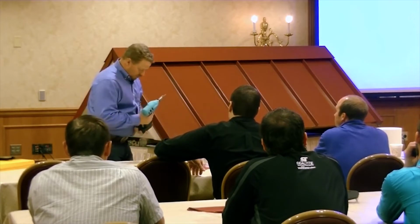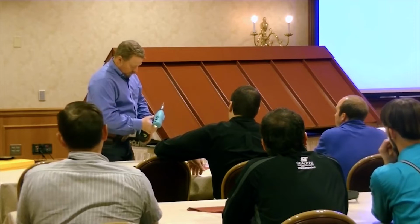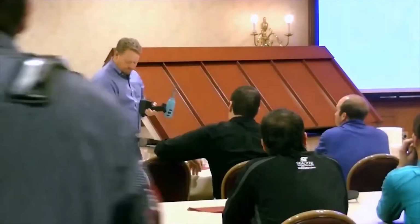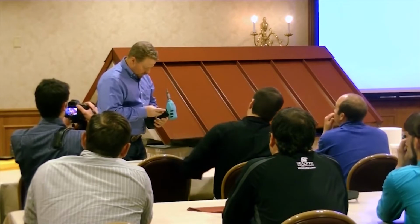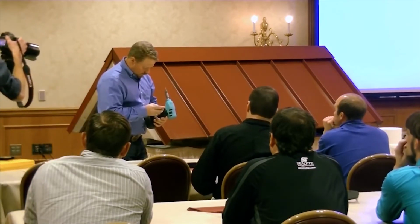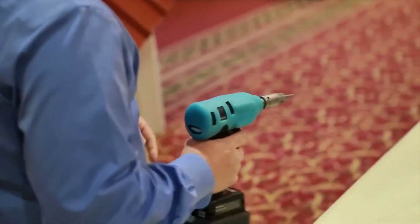The way it works is you reset the power on it, you hold the light, squeeze the trigger, and it puts it into programming mode. You probably can't all see this, but right now it's in F, which is full mode, which means it won't shut off. I'm going to turn it way down to, I'm going to guess we're going to need it to be somewhere around 12, but we'll start at 11. So I've set the tool, can't change now.